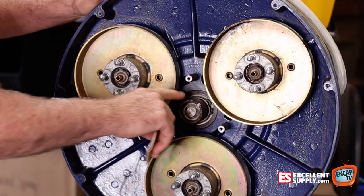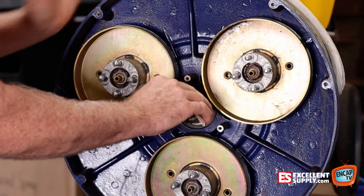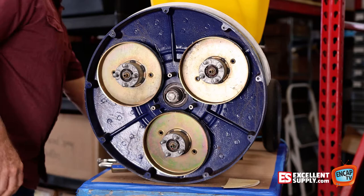The first thing you want to do is scuff up the center pulley. It gets a little glazed and can spin on the belt. I've got some 80 grit sandpaper — I'll rough that up really well to get it to bite again. As I spin the pulley, I'm just scuffing it up and cleaning it, getting that glaze off. You don't really need to do anything to the other pulleys; they're fine and will continue to work properly.